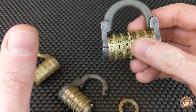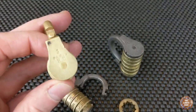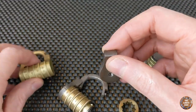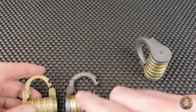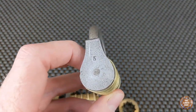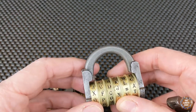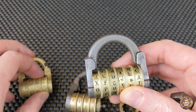The difference between these locks is that you can see one marked number 3, one marked number 4, and one marked number 5. This has nothing to do with the number of wheels on the lock — it is actually the size of the wheel. This one is smaller than that one, and that one is smaller than the next. So if you have a number 6 or higher, you can have just 4 or 5 wheels but it will be a bigger lock, and depending on the number, you may have more possible combinations because there are more letters on each wheel.